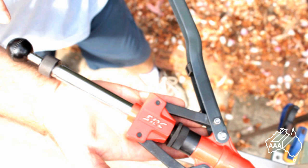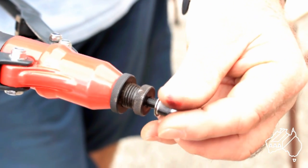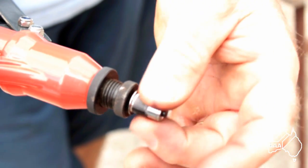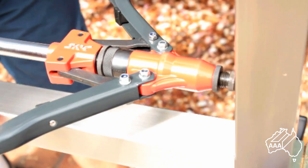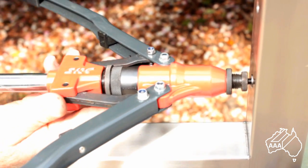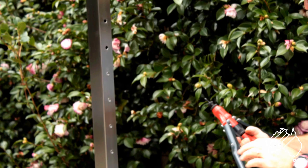You must always support the insert tool when you are doing this or you may snap the mandrel. In case you missed it, here it is again: first push the centre leg back in, position the right-hand blind rivet nut on the mandrel, push the blind rivet nut into the holes and squeeze the handles together, release the handles fully and support the insert tool, then pull the centre knob out to release the right-hand blind rivet nut from the mandrel. Repeat the process until you have crimped in place all of your right-hand nut inserts.